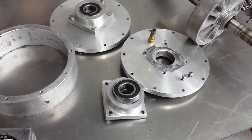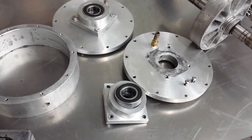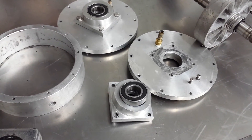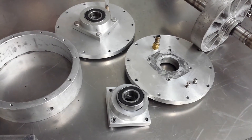If you have the valve too closed, it'll be really lazy to respond — you open the water valve and close the water valve and there won't be a big change in the loading of the motor. If you have it too far open, then it's really hard to actually load the motor down. So you'll have to find a sweet spot in between.